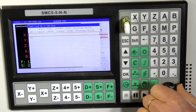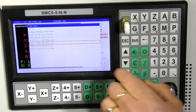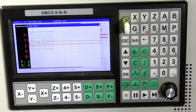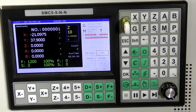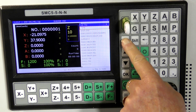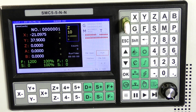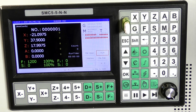Now we're going to select the new file — cut number two. It's a two millimeter ball mill, actually a tapered ball mill. We open that file and check to see — yes, it's a different file, it's the one we require. Escape out of that. It's reading directly from the memory stick. So we'll just lift that up a little, put it roughly in the right position, and run this file.